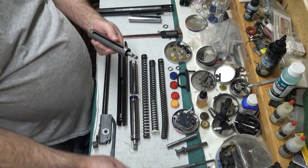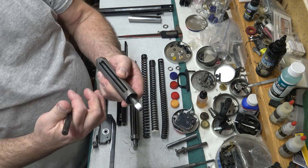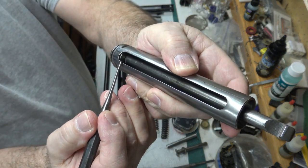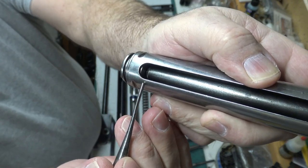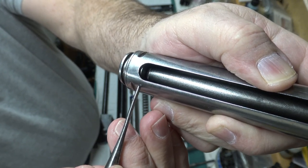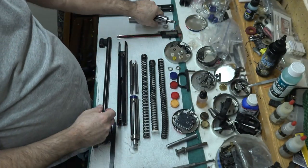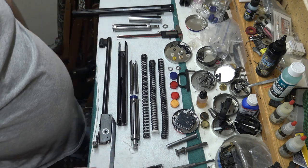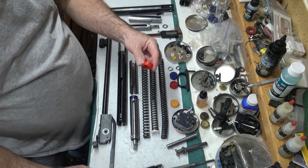On a modern R9 piston, the splines are a lot finer and not as tall - and once you have the sleeve and a bearing washer in there, what's going on with the splines won't affect you. As far as piston seals go, the old one was way too small. The red one was up to bat - the SGS seals are color coded from Air Rifle Headquarters: yellow is the smallest, red is the next one.